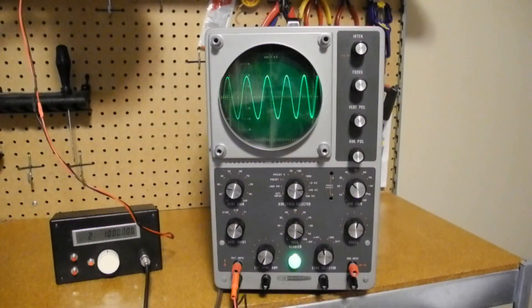Here is a 1 MHz sine wave coming from a signal generator being displayed. Basically you pick a suitable vertical gain range and level, adjust the horizontal gain and sweep frequency range, and adjust the frequency vernier for a stable display. If we calibrated the input against a known signal we can measure the voltage of the input signal. There is a 1 volt peak-to-peak reference output provided for this. I measured this one at 0.485 volts RMS or 1.37 volts peak-to-peak, so it wouldn't be very accurate to use as a reference.